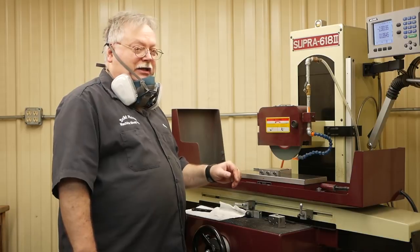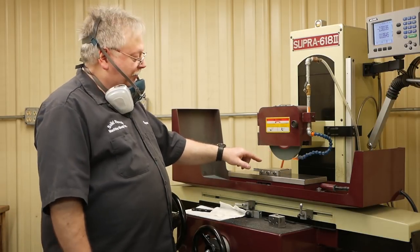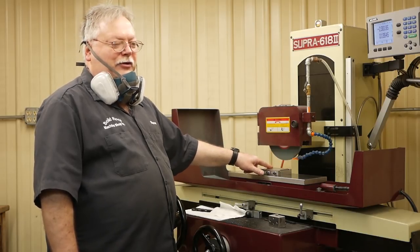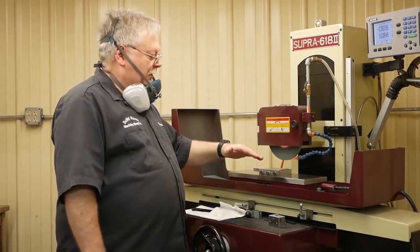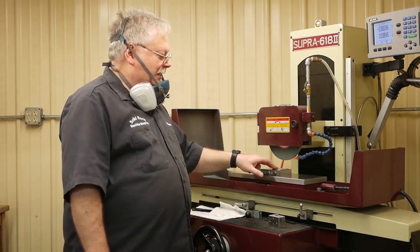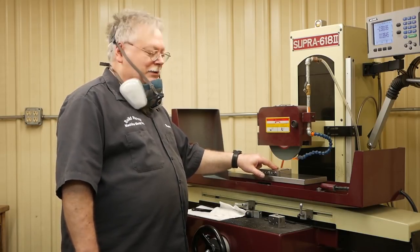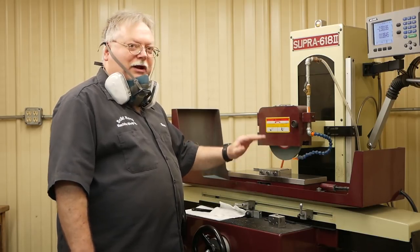And this wheel, you can see it actually grinds really nice. It sounds good. They got the right hardness in there, because yesterday I was taking off, I think, about 11 thousandths, and I ended up with 8.5. So I could tell that the wheel was breaking away in places, which was good. You want it to do that. A couple times in the titanium, anybody that's ground titanium has probably seen it, the wheel will start heating up. Once it heats up, it wants to pull up into the wheel. The nice thing over here is this wheel breaks away when it does that.